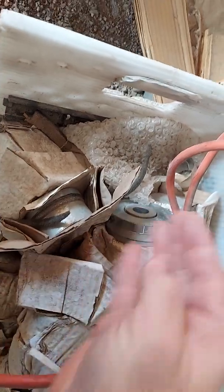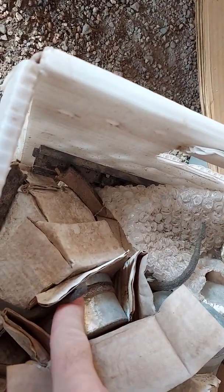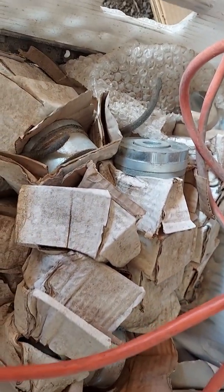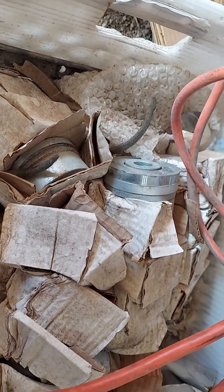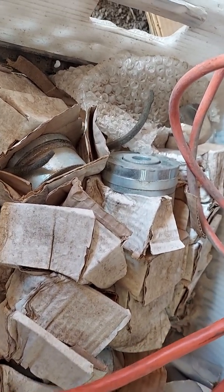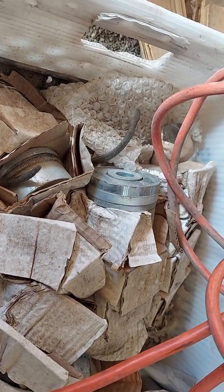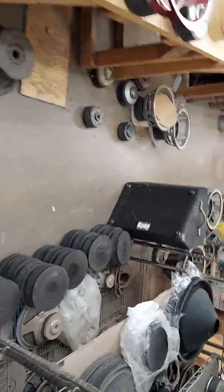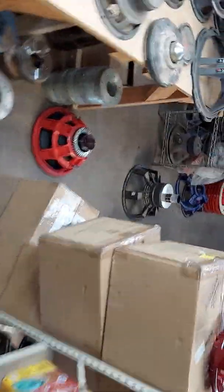Here's one of the Wet Sounds motors and that's the S-Max Sir One Vega Stealth motor. Of course all these are jumbled together so they've got to be pulled apart, and then we put them on the heater to separate the steel from the neo. Once the neo is heated up enough to its Curie point, we can actually use it — it doesn't hurt it at all. It just makes it not magnetized anymore, and really that's the only way to demagnetize anything.